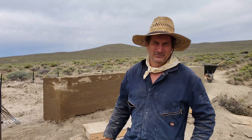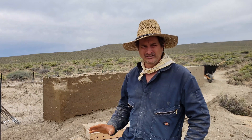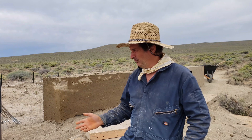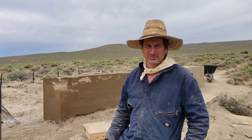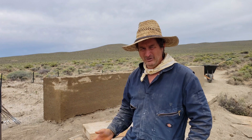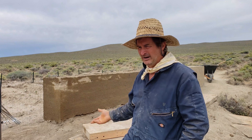Another point: these eight foot forms — eight feet by 30 inches — are just too heavy for one person to work. Make smaller forms, maybe six foot long. The 30 inches high is probably okay, but they're really heavy and it's easy to injure yourself when moving them around or damage the wall sections as you take them on and off.